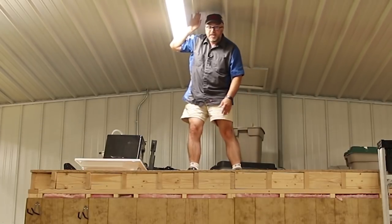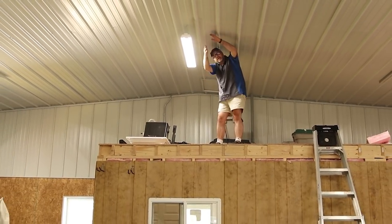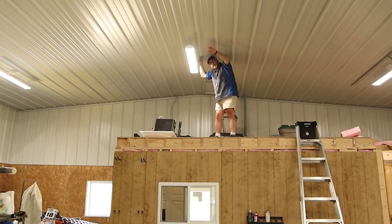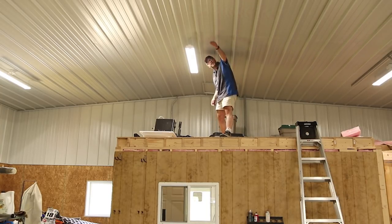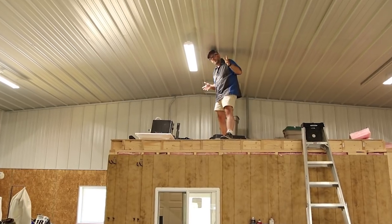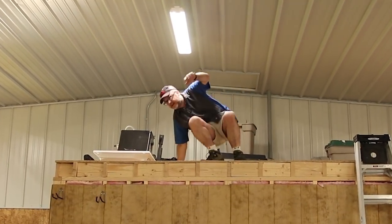There's a decent amount of head space — not quite enough to stand up all the way, but plenty of room for a track coming along here connected to the ceiling joists — or rather the roof trusses. There's one about here, one just past the edge of this floor, and then one further out. If I make my track a little more than 12 feet long I can connect to all three, lag bolt it in with multiple lag bolts, and be good for conservatively a couple hundred pounds — in theory a lot more, but I'm going to try to be safe.